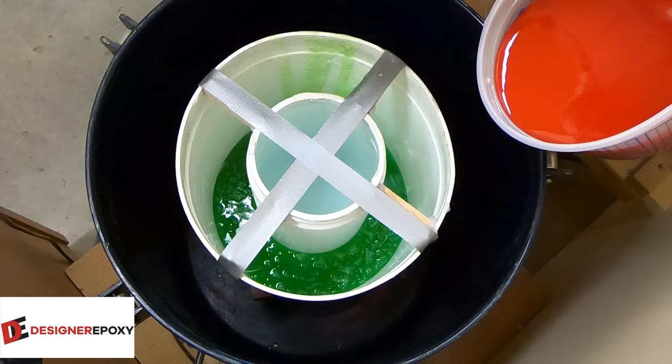And then once I've got it flat, I'll go back to the power sanding, and I don't stay in one spot. I always constantly move the drill. And again, body position with the drill tight into your body, take the strain off your arms and off your shoulders and your elbows is the best way to power sand on the outside like this, I find anyway. But I do find it's sometimes really hard to get feedback from the tool, and then sometimes you have to do some hand sanding. Nobody likes that.